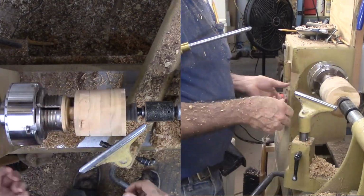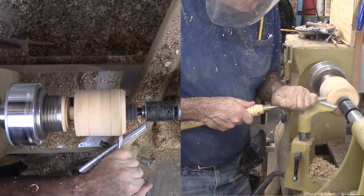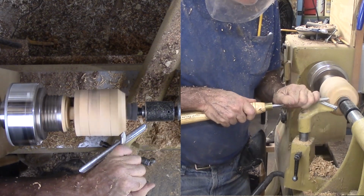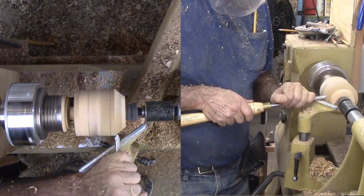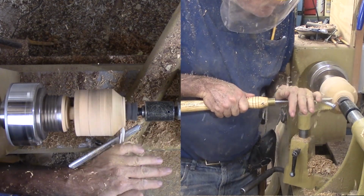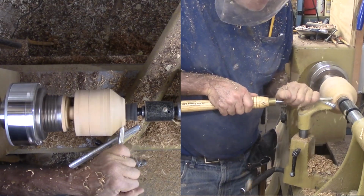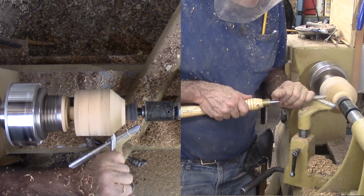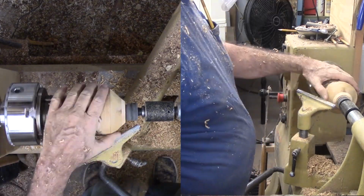As I proceed with the octagon method, I cut the left and right angled side from the mark on the perimeter to the mark on the wood on the cylinder ends. Then mark to divide each flat in half. Then mark again to divide each of them again. Before rounding off the sphere, I cut a shallow tenon on each end where I hope it will not interfere later with the sphere. Then go ahead and round off the sphere, but leaving that tenon.